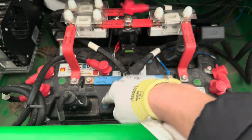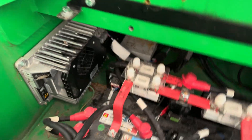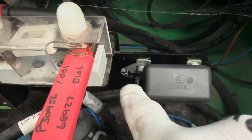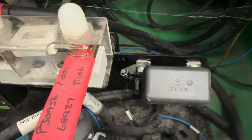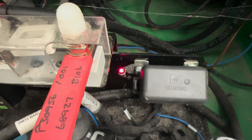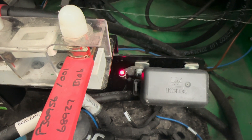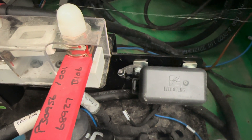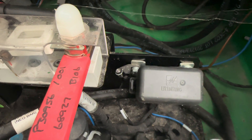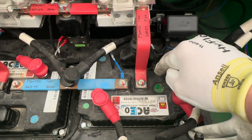I've removed the covers so we can see the controllers. That's a two drive controller setup — on the left hand side is the slave, on the right hand side is the master. The LEDs are flashing: counting the flashes gives us three, nine, nine — so the code is 399.